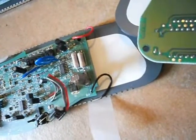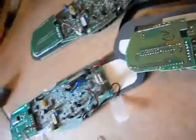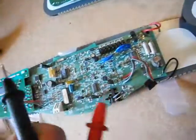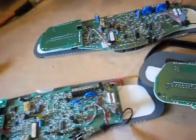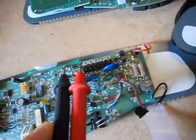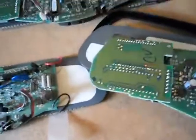So now we get another big mess — gotta clean it up. The stripe side is your negative. So you put your negative lead over there and your positive lead on the other side. Yeah, my two-second memory was working correctly — negative is the stripe side, positive side is the black side. So you put your meter leads like that if you want to check it. You're gonna get flow. Put it around the other way, you're not gonna get flow. That's how you check your diode.